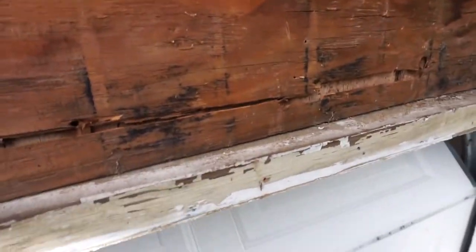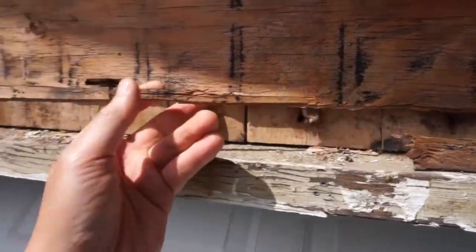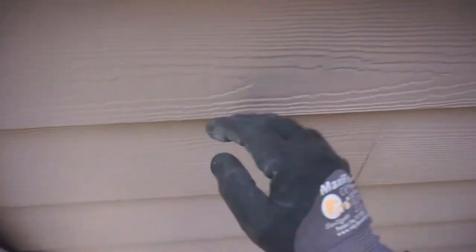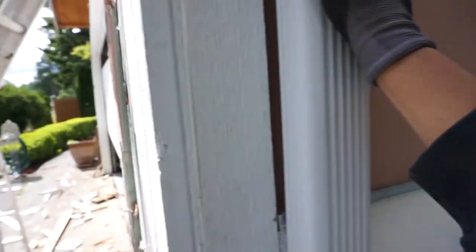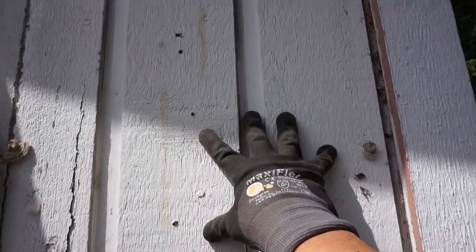Here's another reason why I'm replacing this siding — because if you look under here, all this got water damage. This is actually the old sidings. It is made out of hardbacker, so it is a lifelong siding. But it just doesn't groove, man. It just looks ugly. The previous owner put this 2x6 beam right across there with all those gaps, which when the water goes down, it trickles right behind this thing. That is why I am removing this — because this is what's underneath that hardbacker siding.